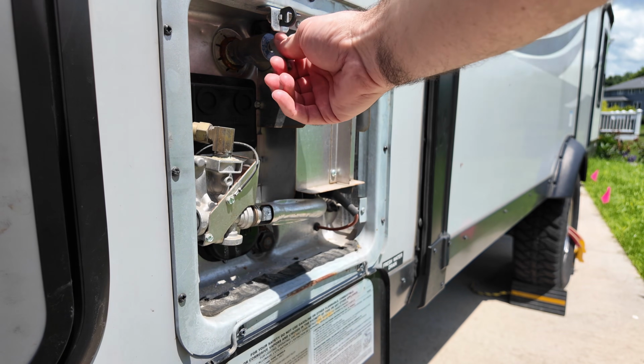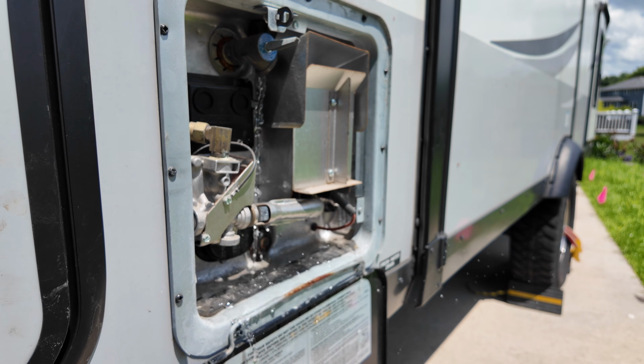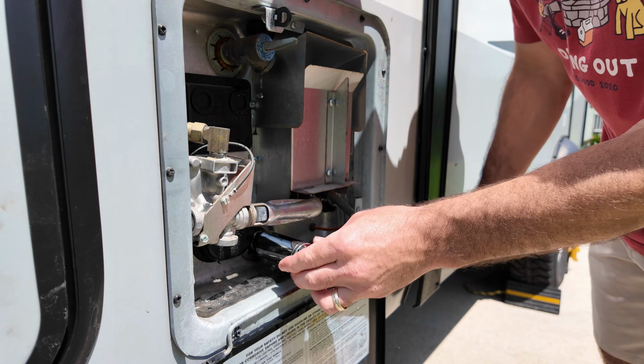So I will empty the hot water heater, we will rinse it out with the hose the best we can, and we'll put in the new anode rod, and hopefully that will take care of the rotten egg smell that we've been having with our hot water. So release the pressure valve first. And then when you do this part, you should stand off to the side.